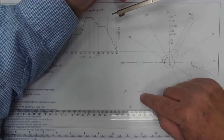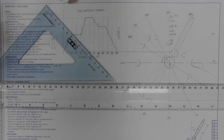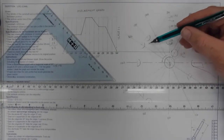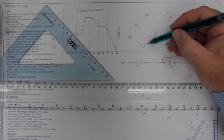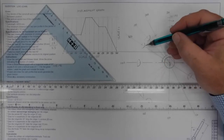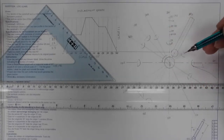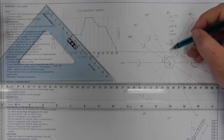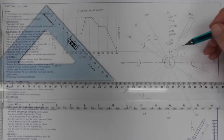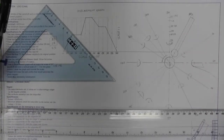Again now, remember to take your semicircle with the size of your roller and draw that in. There I've got all my semicircles drawn. Remember, we've got to try and find a tangent that's going to flow along the shape, and it's not exactly where the circle touches the pizza slice. It can be slightly different, particularly somewhere like here, where this is going to be your edge to get that to fit around nicely. There's no way it can be that point. So I'm going to join that up now.